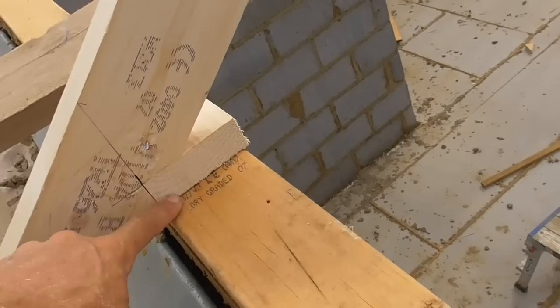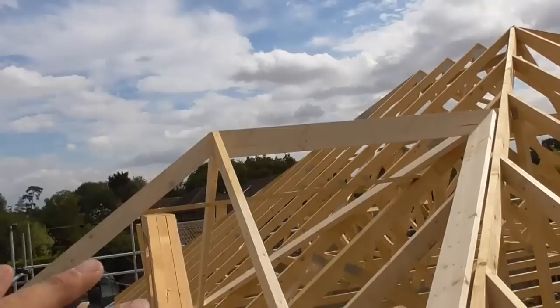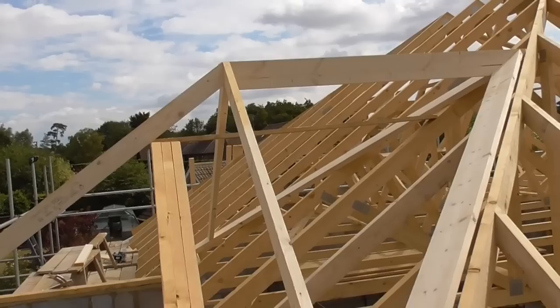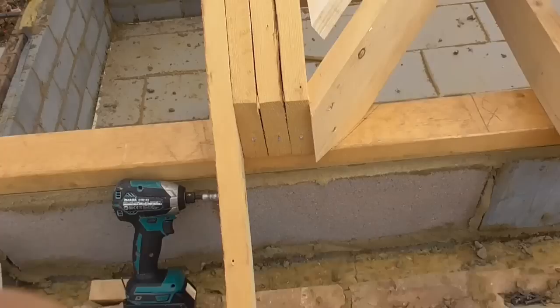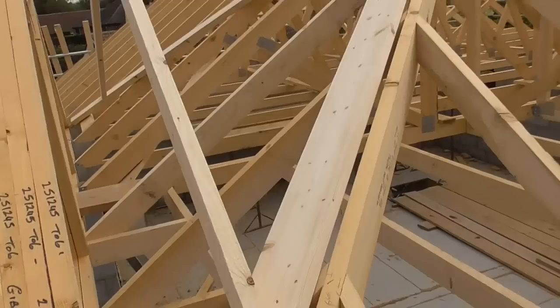This is the correct pitch of the roof, obviously, and where it meets at the top there. Now you see, we had to project some lines to start with, and you'll see I ran that ridge through, and once I've got these jacks up in the right place, I'll be able to cut all that off. As we look up there, you can see that this would be the last set of commons, but obviously they're jack rafters now. They're all in the right place. Everything's lining through really, really nicely. I'm really happy. So I'll infill the rest of this with jack rafters,